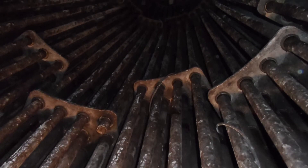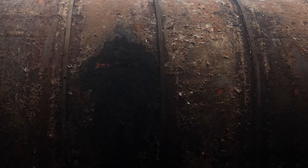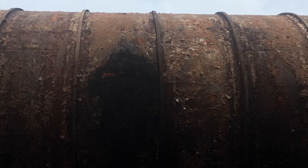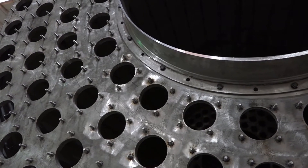There are a variety of different reasons to use an alloy on a dryer. One of them is chemical reactions. On one hand, you have a corrosion issue where if you have an acidic or basic environment, the material will react with the dryer itself and cause extreme wear, often eating straight through the shell. On the other hand, you have instances where the dryer reacts with the material being processed, contaminating that material.